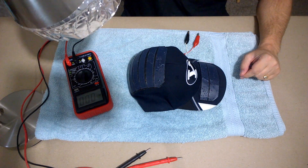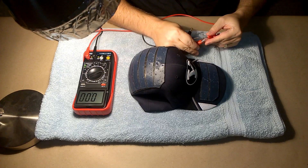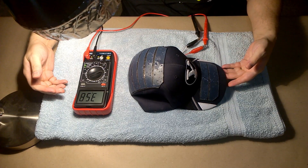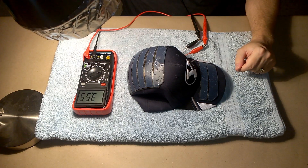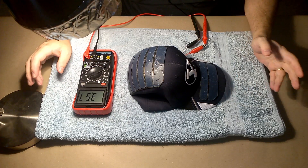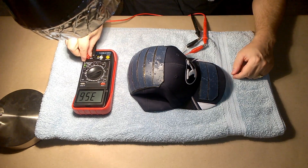Let's get some light on this and get this over to volts. Let's just hook this up real quick — and we're getting 3.6 volts. I can change the angle and get a bit more or a bit less, but basically 3.6 volts. Now this light is nowhere near as strong as the sun, especially when it comes to amps. The volts are usually close — call it minus 20% — but it's still good for testing to make sure that it basically works, like we're doing now. So we're getting 3.6 volts.